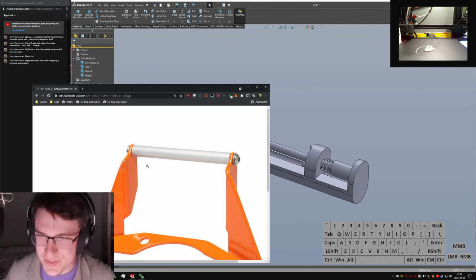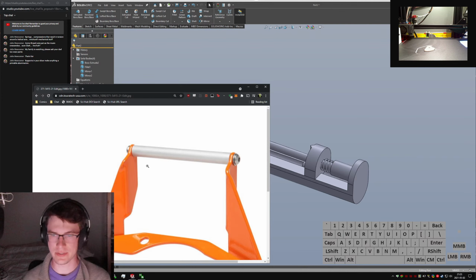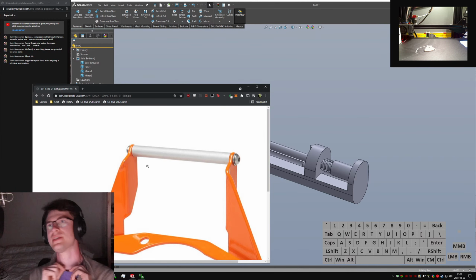Well, supports will make a lot of things possible, but they don't make everything possible. I was talking to a CNC programmer today at the Enduro I was volunteering at, and I learned a very interesting tip: any interior radius you make on an aluminum milled CNC part, add 10 thou to your nominal fractional diameter. So say you want a half inch radius, instead of 0.5, make it 0.51 or 0.52. That makes the CNC programming go so much easier because you're not going to have tool chatter.